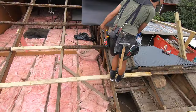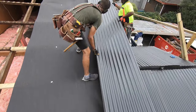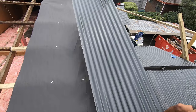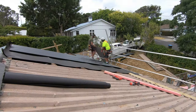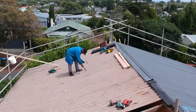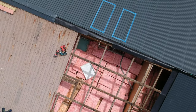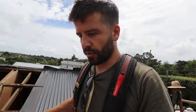We're off to a tremendous start on this side. We had to replace a few purlins. Look at this new roofing — we just put a couple of screws in each sheet to get them all down, and then it's easier to screw in a straight line after that.